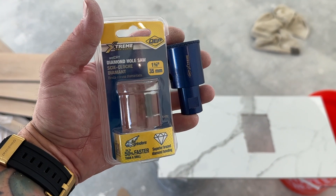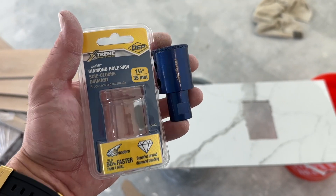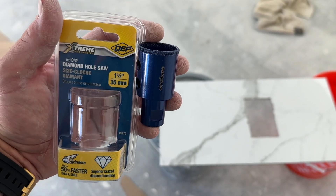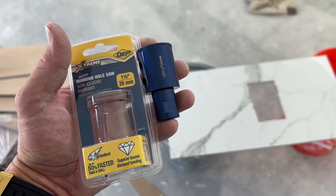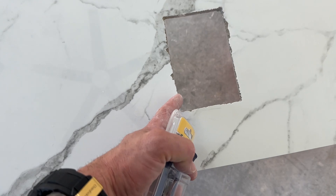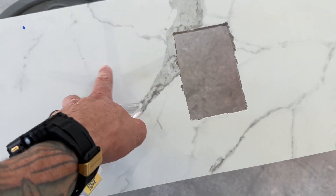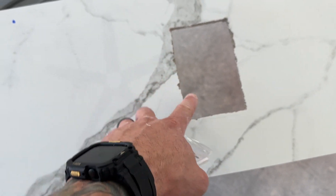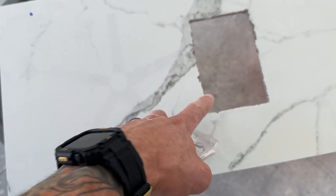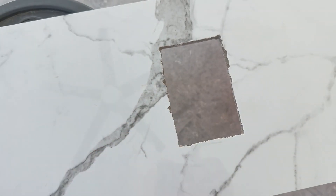What we're going to use to drill that hole is this diamond hole saw — it says specifically for tile or ceramics. They do have a couple of different ends that are open or continuous. Just make sure you get a hole saw listed for the type of material. That way we can avoid bad breakout like this — I used a masonry blade on this one and it gave me a lot of chip-out. This will still be covered by my flange, but I just wanted to show you that if you use the wrong type of bit, this is what can happen because it's not set up for the right material.